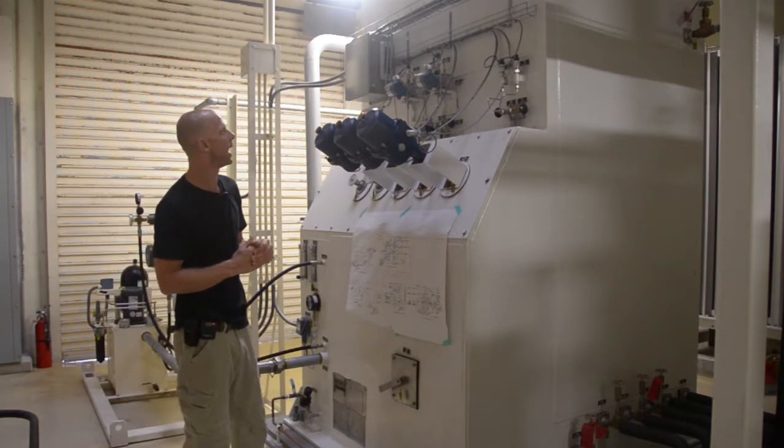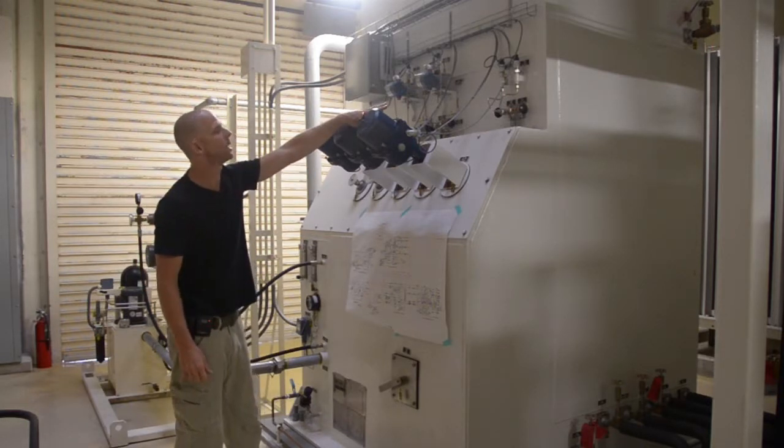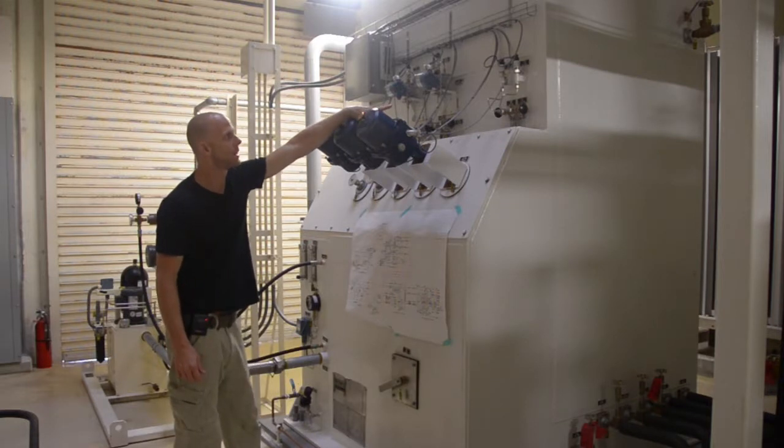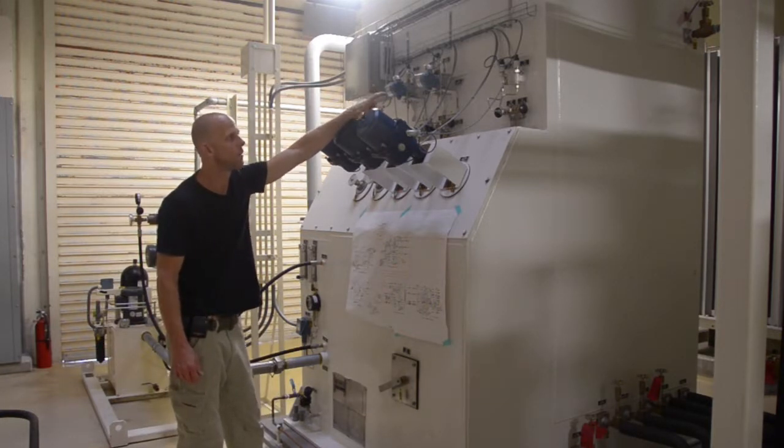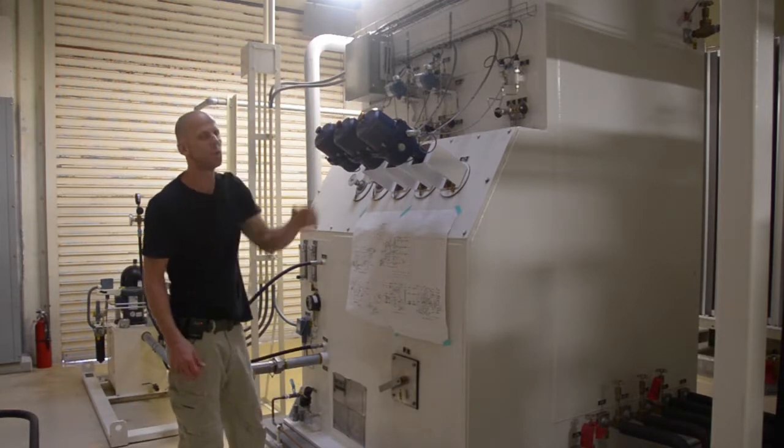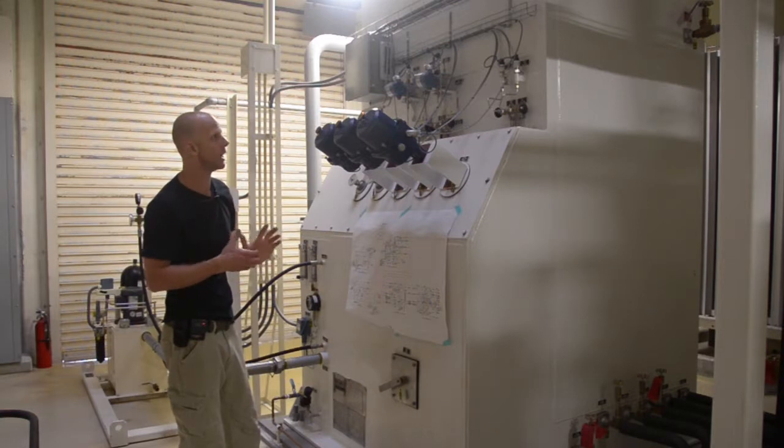Okay, you'll also see that we have pressure transmitters. We have a turbine inlet pressure transmitter and a turbine outlet pressure transmitter. If ever these pressure transmitters need to be exchanged, if they become faulty, always be sure to check the range written on the actual transmitter itself, because if you fit a replacement with the wrong range, obviously the PLC will give an incorrect reading. Okay.